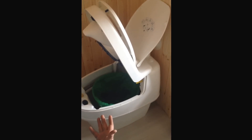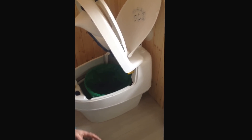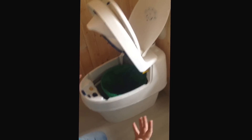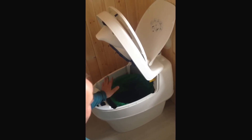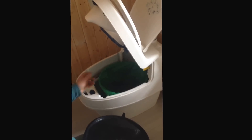The processing of black water — sewage — is very energy intensive, whereas with this you've got a bucket where the solids go in. They supply you with cocoa shell, which absorbs moisture and smells. The bags it comes with are biodegradable, and at least every three weeks you should change them because after three weeks they'll start breaking down.